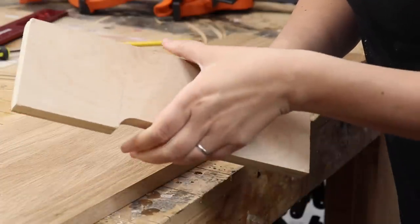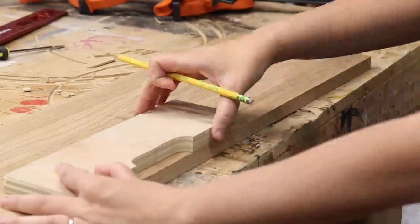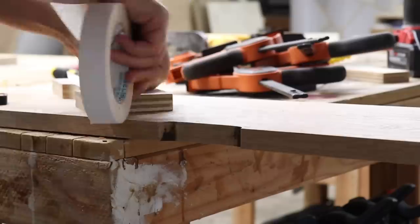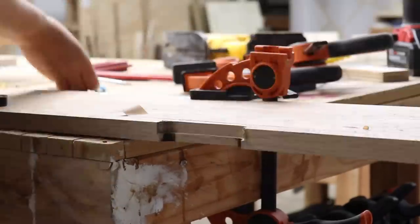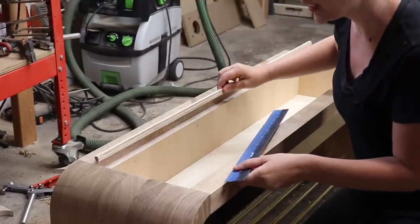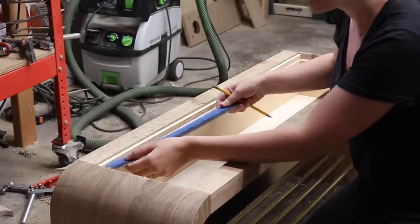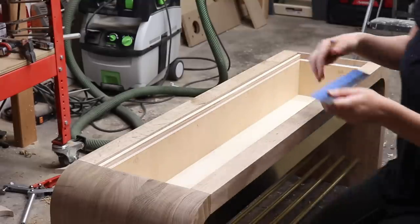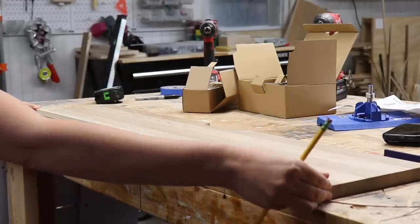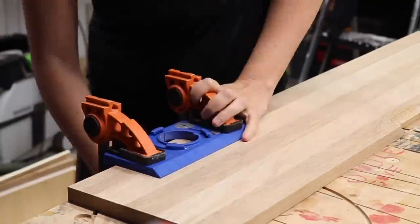I have this template from another project where I used it to make some drawer pulls and I'll try it here. I marked out the center, lined it up, marked it out, cut away at it, and then used a flush trim bit with the router to finish the cut. Before finish sanding, I want to install the lid hardware. I made a story stick that's the same width as this part of the bench, measuring the same distance from the ends while making sure to avoid the screws in the sides. I take the story stick, line it up with the lid, make sure the ends are flush, carry over the lines, line it up with the zero mark on the hinge jig, and drill away.